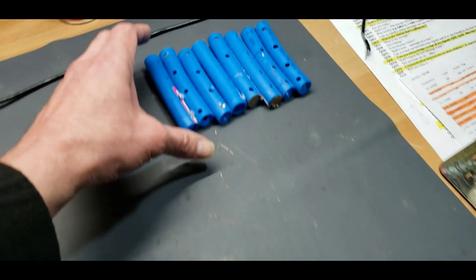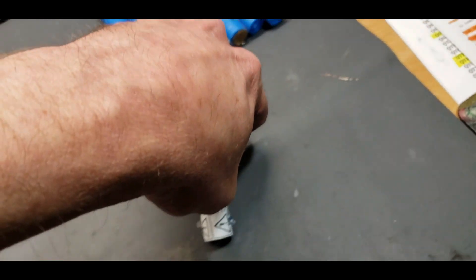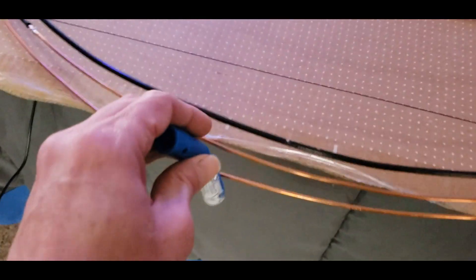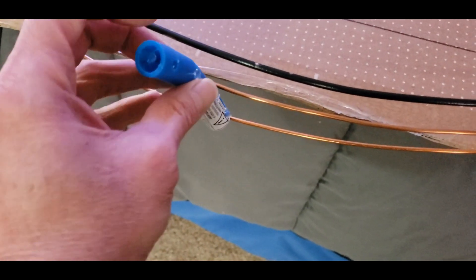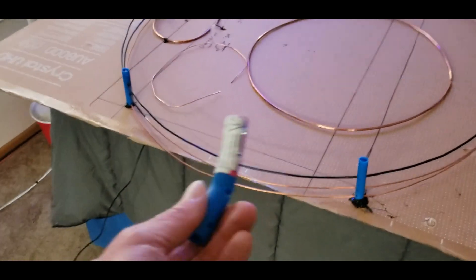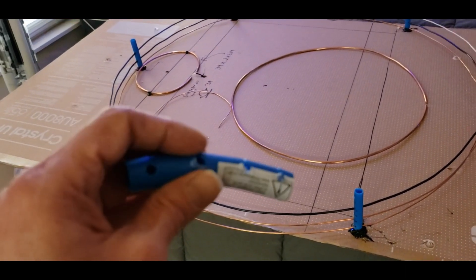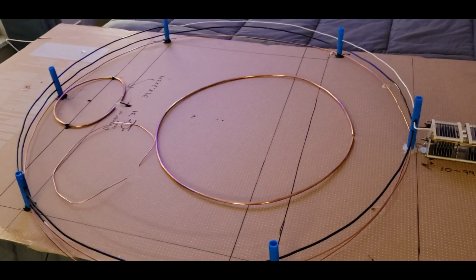Here's another approach: I took a razor knife and cut the PEX pipe in half lengthwise. If your wire is thin and floppy — like speaker wire — you can clip each conductor into the cut slot and it holds the wires apart and separated. You can put as many of these spacers as you want since they won't hurt the antenna.